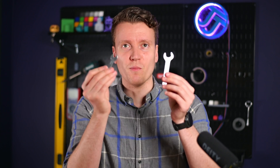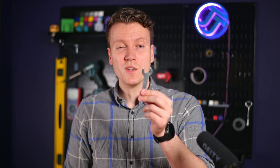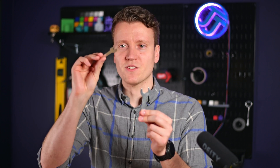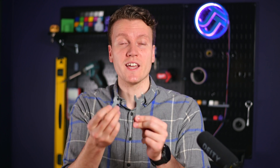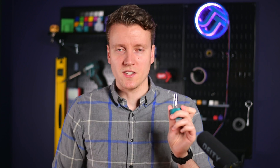I really don't know why I waited so long using this old method. These are two really cheap wrenches that came with the 3D printer — one you use to hold the heater block, and the other cheap piece of metal you use to rotate your nozzle off. It makes it so difficult to change nozzles, so I just put off changing nozzles when I really shouldn't. Eventually you need to change your nozzles, especially if you're using brass ones and a bundle of cheap ones like I am — just a random cheap pack I bought off Amazon. But this makes changing those nozzles so much easier.